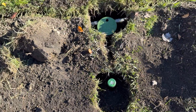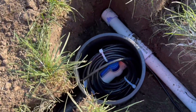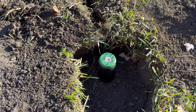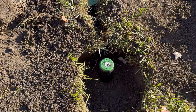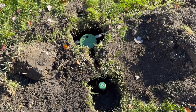This is basically what a buried setup will look like. We've got all our cable organized in that valve box and everything connecting to the head. The head is set at the depth we want — I hold the head in place with my hand, scoop some dirt in with the other hand to set it, wiggle it around until I feel good about it being level and at the grade I want. I don't completely bury it yet because I want to make sure I can test everything out. All the heads are in, all the cables are connected and in the trench. Now we're going to make sure there are no leaks at the connection point through the flex hose and the elbow going into the head unit.